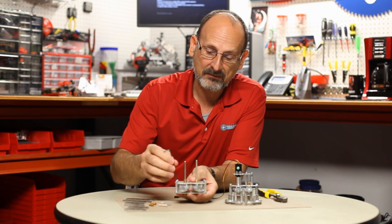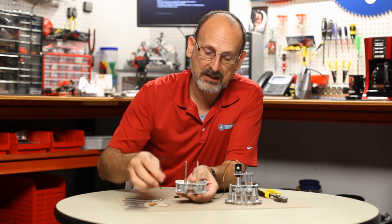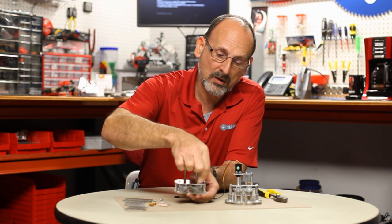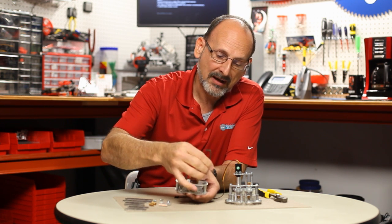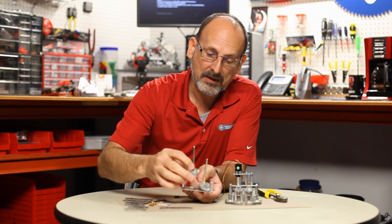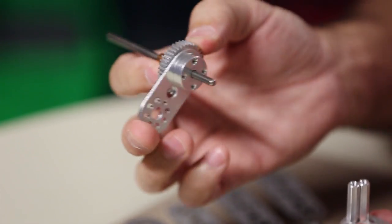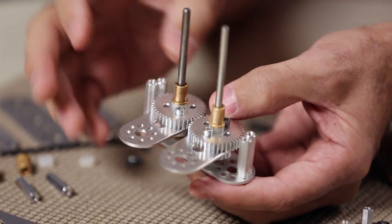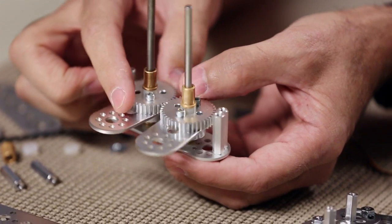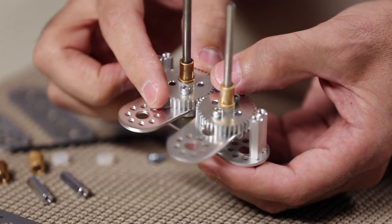To show you what that's made up of, I'm going to take these off. I've got two 96-millimeter flats along with one-inch standoffs that create the framework. I've got my 42 gears mounted on small plates with axle hubs, sitting in one side of the plate. The one-inch standoffs form the framework, and as you can see, those gears mesh together and create that gripping motion.